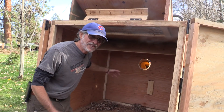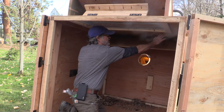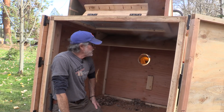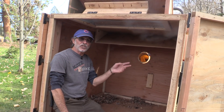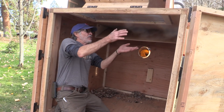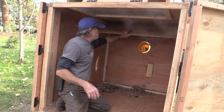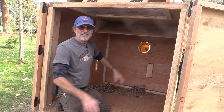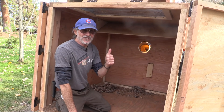You can call it a baffle or a deflector. Originally we attached it right here at the back so it actually covered the vent. What we discovered was, as the leaves come in and the air begins to flow, it curls right against the back of the doors like a wave, and as it comes across that wave it wants to exit through the screen. But with the deflector right there, it filled the whole deflector up like a shelf and it wouldn't let those leaves out — it just plugged the vent completely. So we moved the deflector forward, and now it's working really nice, super efficient.